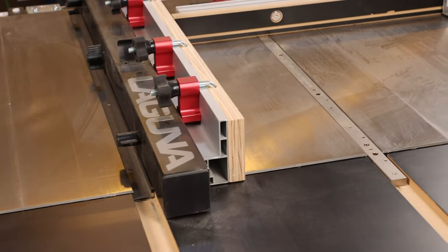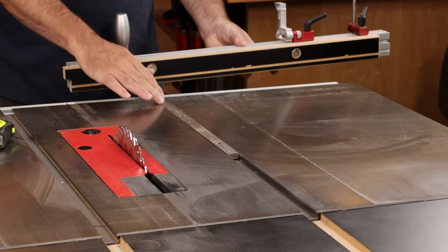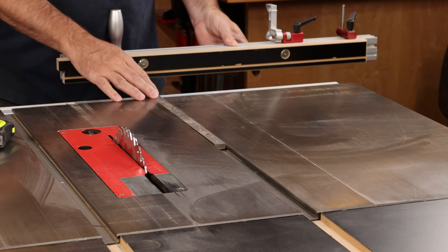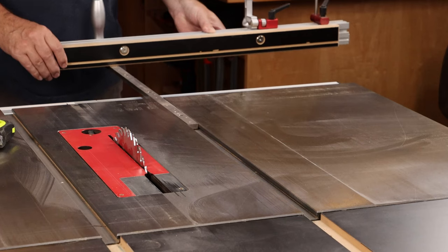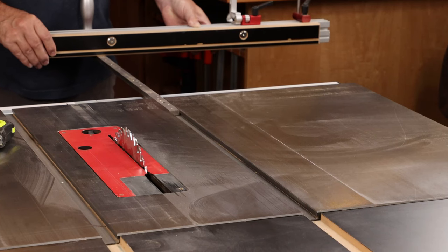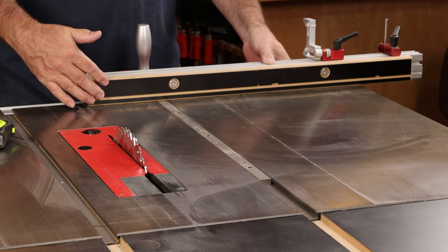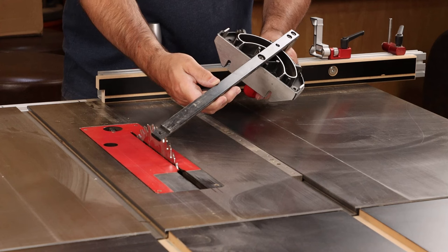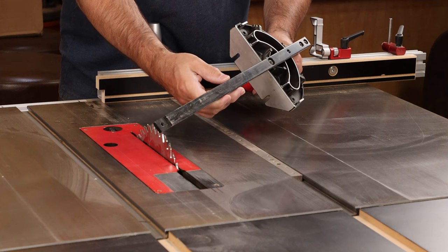Normally I have a dedicated dado blade setup on the Fusion saw, but periodically I'll switch that over to use the two-rail sled. Let's use this Woodpecker's miter bar to show how the length of the miter bar really determines how wide a panel you can cut. This is a 25-and-a-half inch miter bar with some interesting features that make it more stable than other models. As you retract it, there's a point where you'll lose stability — with the Woodpecker's, you need about four inches engaging into the track for it to feel stable. On this particular table saw, that gives you a 24-inch panel width capacity. I would personally avoid short or shop-made runners for table saw sleds — buy metal and get the longest runners that make sense for your setup.